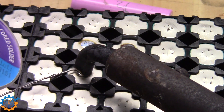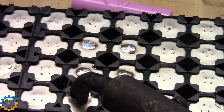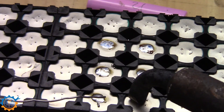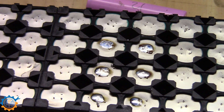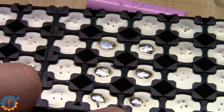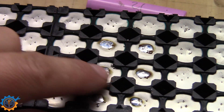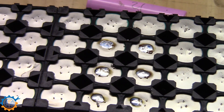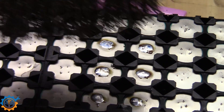So to summarize the motion: pressure, solder, wait, and done. What you need to check is that the solder flows out nicely. The residue you see around the joint is actually the flux core, and I suggest that you clear that up before you do anything else — just take this tool and clean it up.